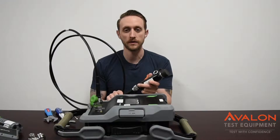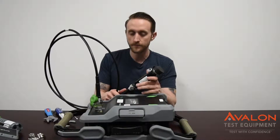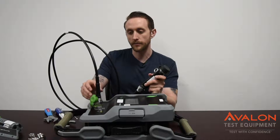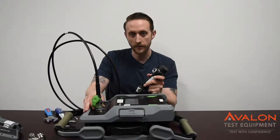If you're not seeing anything that's acceptable, go ahead and take everything back off, clean it all again, put it back together, and run the test again. If you're still having an issue, then most likely your problem is in your cable, since you've already op-checked the load and the unit itself.